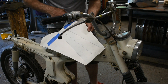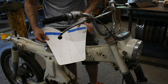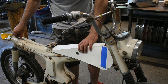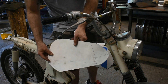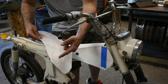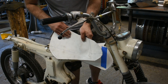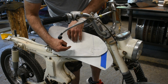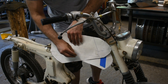These sides are going to correspond with your side profile. What I do is have these lines here, leave big rectangles just like before, bend it, and put it on the bike just like this. Then I'll grab my side profile, put it on in the proper orientation. Remember, when we made this profile, we put that line on it that represents where the backbone is — where that backbone line is, is going to be where the top of the tunnel is. So you line that up, trace the profile, take it off, cut it out, and your tunnel corresponds with your side profile and everything lines up like it should.